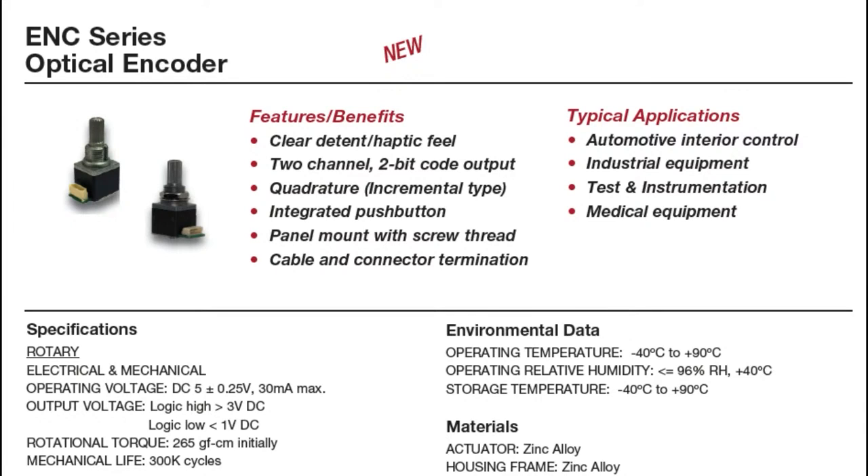The rotary encoder is the one you use for channel one, zoom one. It really makes it kind of sad to use the oscilloscope because the rotary encoder is busted — it's a mechanical rotary encoder, not an optical one. So if you're working on something that's going to be more than a thousand bucks, go with an optical encoder and not a mechanical one. You don't want your very nice industrial, medical, or test equipment product to fail because of a $2 mechanical component going bad.